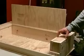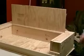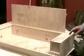I'm going to start by making the inner and the outer frame — they're both one by eights. The inner is 12 inch, 30 inch, 12 inch. The outer is 15 and a quarter, 15 and a quarter, and the back one is 36 and a half. That'll make the basic frame.